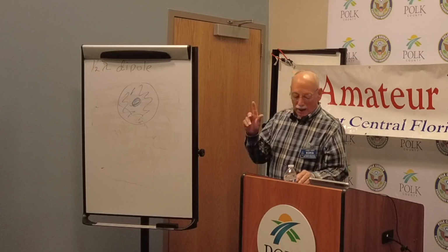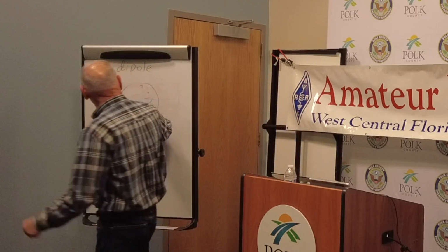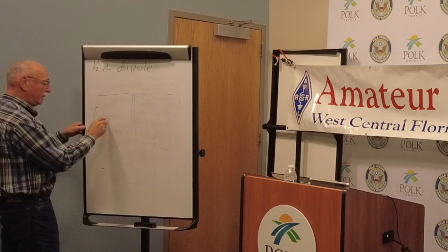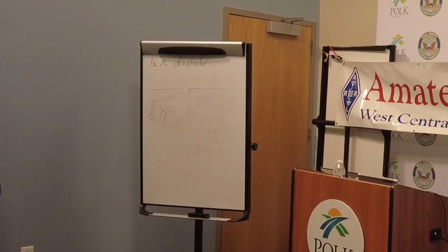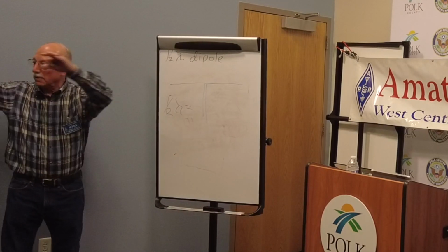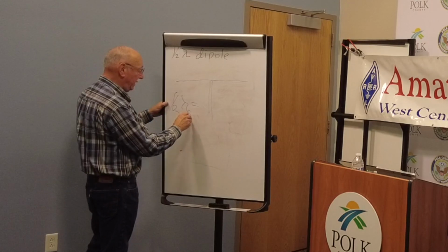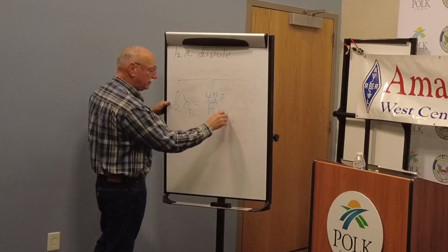Yeah. Another thing about velocity of propagation, and we can go back to our dipole. How do we figure out how long to make the dipole? Frequency you want to transmit at. Okay. And what did we talk about? You calculate it out. So you take, in theory, the ideal situation, if you calculate half wavelength in feet, it equals about 492 divided by the frequency in megahertz.